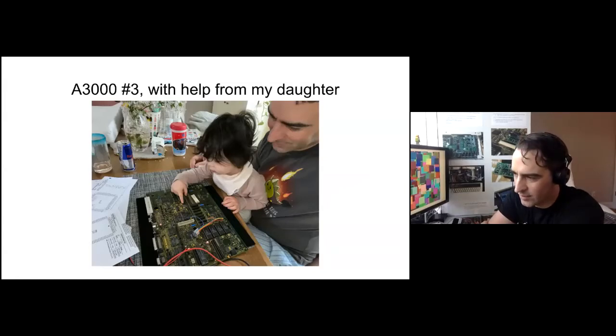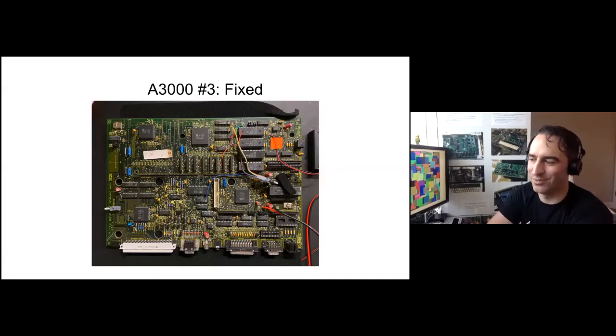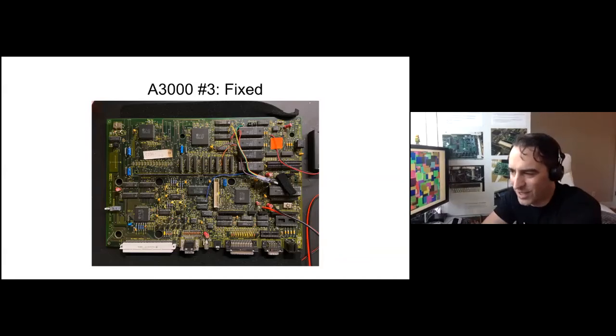Board number three — my daughter gave me some help with that, so her first Acorn repair project. This board was a really interesting one because it looked relatively clean, although it was missing all of its capacitors. Presumably someone decided it needed a thorough recapping, removed all the capacitors, and then got sick of it and dumped it. So I finished that — there was a lot of capacitor soldering to do, but they were all pretty shiny and nice. The board didn't boot. The self-test showed me the ROM was aliased, so one of the ROM address lines was bad — A15, broken between the ARM2 and the relevant address latch. The video and sound IRQs were failing because I'd soldered on capacitors but there were some headers and jumpers I needed to add. Putting those in got the video clocked and it all worked.